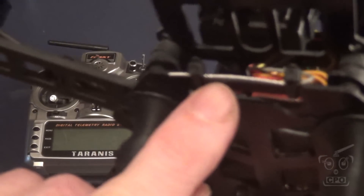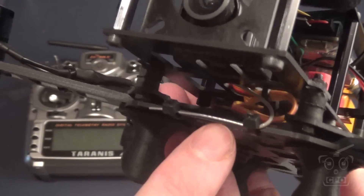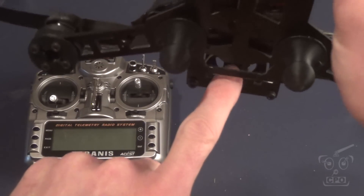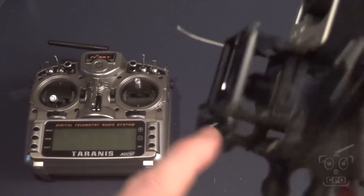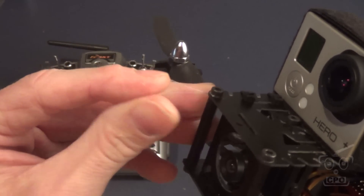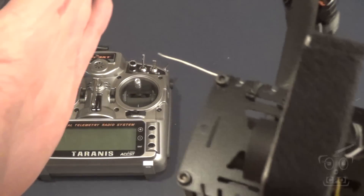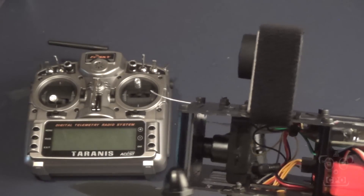My antennas: I have one antenna strapped right here. Because this is the G10 version, not carbon fiber, I can lay an antenna right along that and it won't attenuate the signal. So one antenna is that way, which gives me good visibility to my transmitter even tilted way forward running. Then I've got my 90-degree offset of that pointed out forward here. I debated pointing it up or forward — I don't know how much it'll matter from a reception perspective — but I wanted to get it as far away from the other antenna as possible. It is the most vulnerable thing on the quadcopter, but the worst thing that's going to happen is it bends out of the way whenever I take a hit.